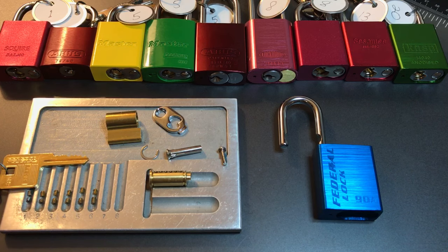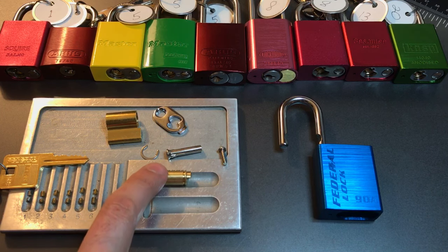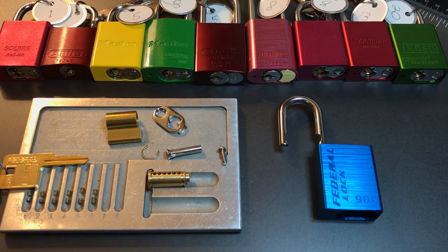We get a point for each security pin and for each anti drill pin, so that gives us 12 points for the pinning. We get another two points for having this be a six pin core, so that's 14 points. We don't get points for having a paracentric keyway. We get two more points for needing a specialized pick, putting us at 16 points. Two more points for counter milling gets us up to 18 points. There are no deductions for being bypassable, because this core is not of a bypassable design. So 18 points total. It looks like after — I guess this is our 10th lock — we are finally knocking the Chinese generic out of a podium position. Not bad for this Federal Lock. It's the new lock in second place.